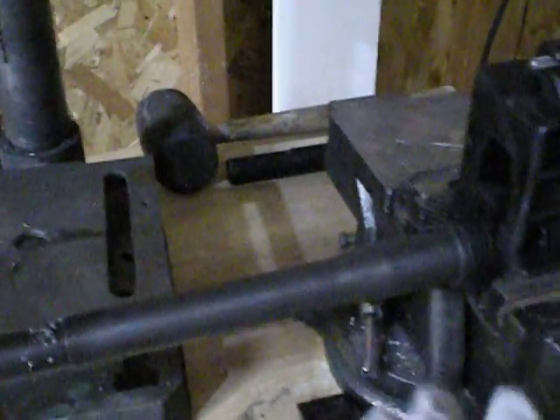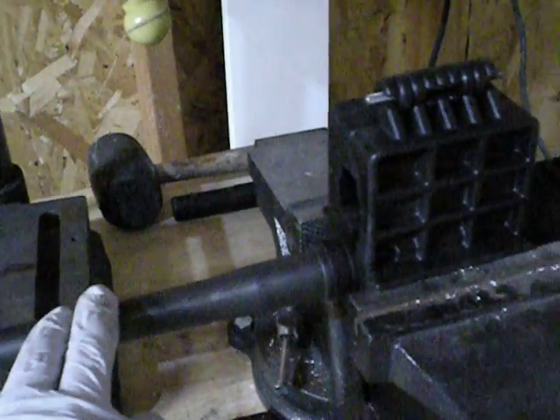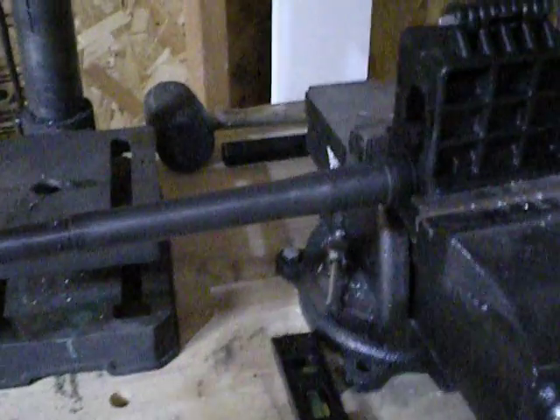So if you're doing multiple barrels, I highly recommend doing it with the action block — just have a receiver ready that you can slide the barrel into. If you're just doing one barrel and you don't have the action block, you can use a couple pieces of wood in the vise as jaws, or soft jaws if you have them. It's a lot more work to get everything lined up perfectly. I just hang the receiver off of the back and use that as my reference for leveling. Get both planes leveled up, get it clamped down, and make sure it's supported under the barrel by the drill press table.